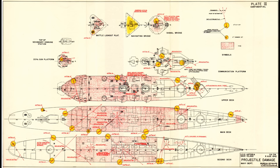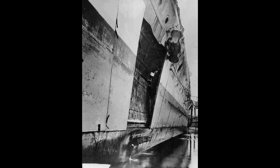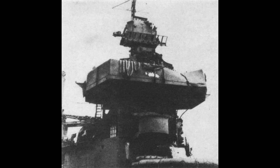For example, if you have a fire on the starboard side, you might angle the ship so the wind is blowing from port to starboard — that blows the flames away from the vessel, which is preferable, but might mean starboard compartments not initially on fire are essentially being sacrificed. So the initial damage report of 'bomb entered here, shell entered here, torpedo hit here' may not reflect the full extent of what will actually need repairing in the end.